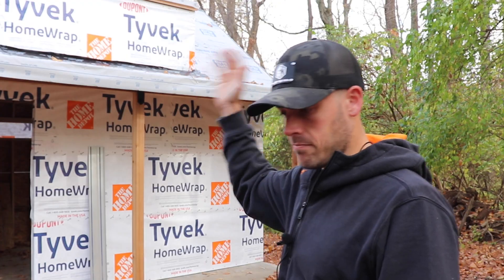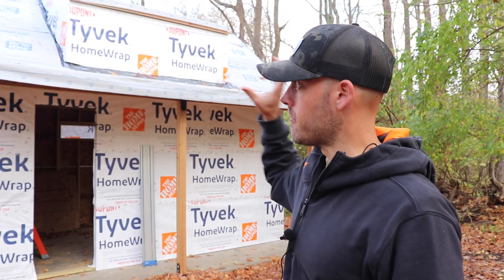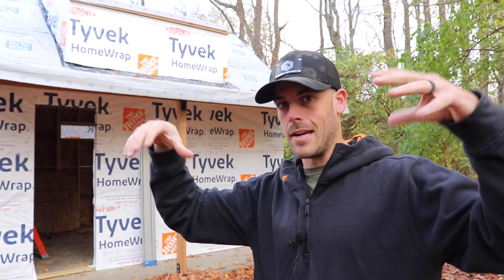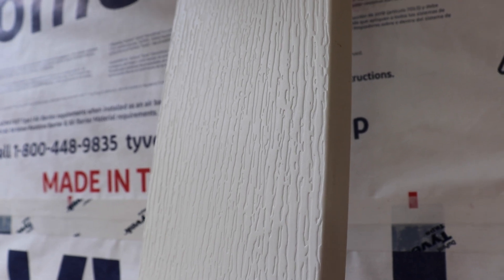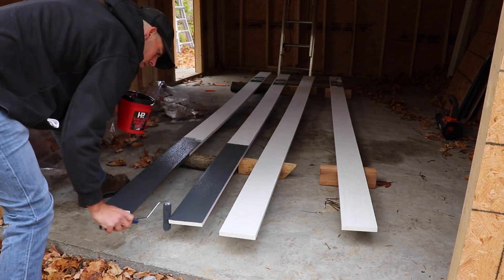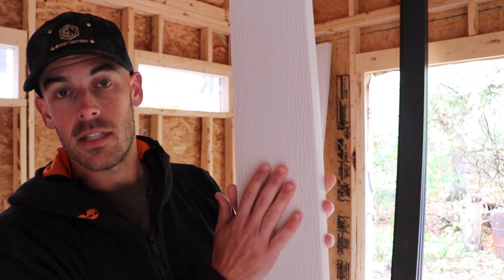As I mentioned at the end of the last video, I'm putting on a metal roof, which I definitely have no idea how to do, but I've watched so many videos that I'm full of false confidence and I think I can do it. I think the first thing I need to do is actually put up the fascia boards around the perimeter of all the areas that I'm roofing, so that all the trim can overlap. For that fascia trim, I'm going to be using PVC — I've got a bunch of 1x6s. I've even pre-painted some for the big tall gable sections because I figured it'd be easier to paint them now rather than later. Let's get all this stuff cut to size and put it around the edges so we can start on the roof.